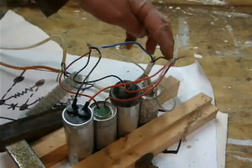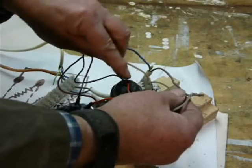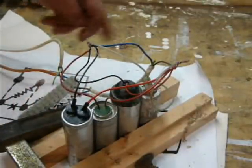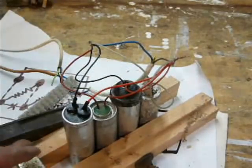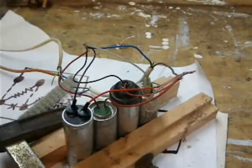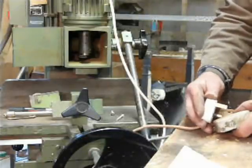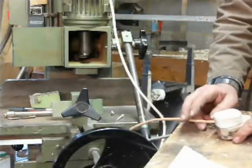From the brown, the wire comes along and goes into one, two, three, four capacitors, and then the other side of each capacitor — one, two, three, four — is connected to the blue, which is eventually connected to the black, the third connection on the motor. So that is four capacitors in parallel. Four eights makes 32, so we've now got 32 microfarads of capacitance on this motor. Boom — it started a bit quicker. I think 32 will do.